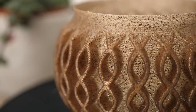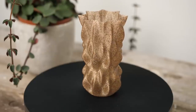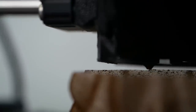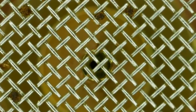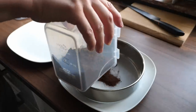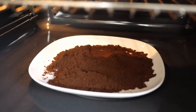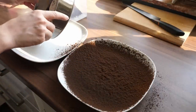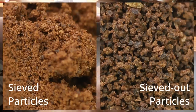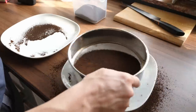The material seemed a bit stringy, which I also experienced with other wood-filled filaments in the past. Otherwise, the parts turned out really nice. Unfortunately, only using this material with a larger nozzle wasn't an option for me — who knows if there's another particle that might even clog the 0.6mm nozzle. This is why I ordered a 60-mesh sieve, which has a hole size of around 0.25mm. Since this is smaller than our 0.4mm nozzle, it should ensure no particles can block it. Due to the stringing, I redried the leftover coffee grounds for 4 hours at 100 degrees Celsius and then sieved them. A substantial amount of particles didn't make it through, showing how many potentially dangerous particles were still in the mix. I tried further grinding the leftovers in a mortar but had little success — a ball mill might be really beneficial for such an application.